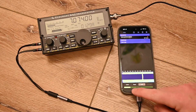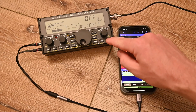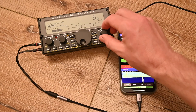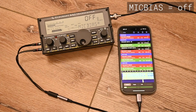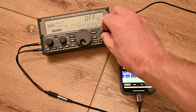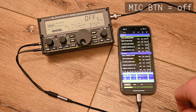There are a couple of things to be aware of regarding the settings on your KX2. If you have your mic bias on, that applies a three-volt bias to the microphone, and that can cause all sorts of chaos when you're using one of these analog-to-digital converters. So make sure you turn that mic bias off. Similarly, you can have issues if you leave the microphone button turned on, so go ahead and turn off that mic button.